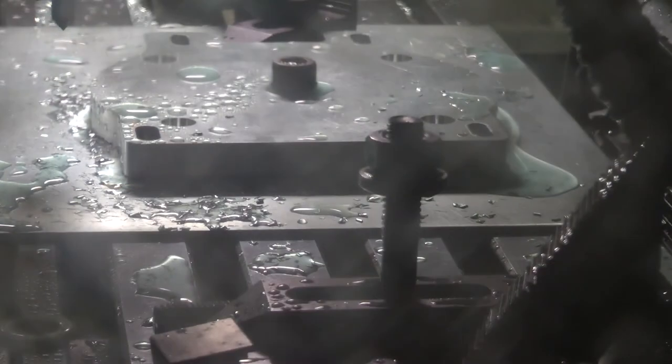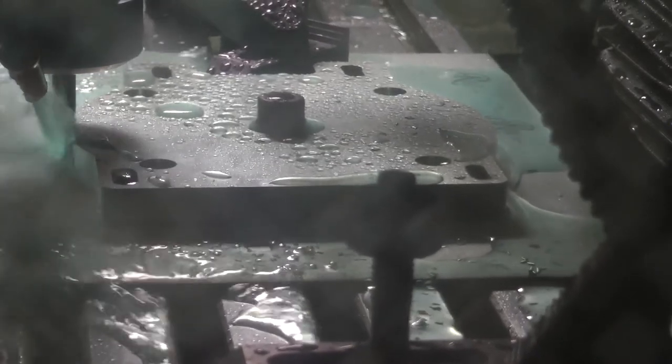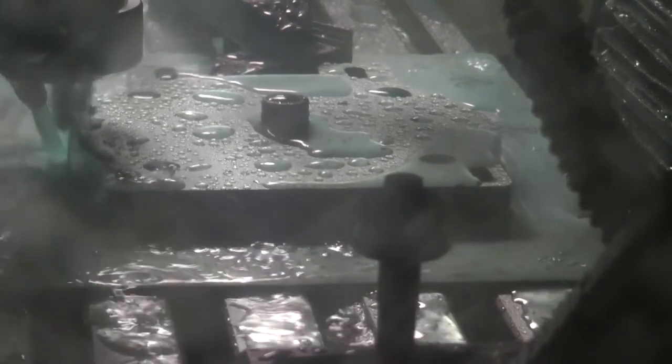This is a bit of an interesting cut. I wanted to put some sort of large 45 degree chamfers on the outside here, chamfers that were wider than the actual chamfer mill. So I ended up kind of stepping the cut in the CAM program. I used RhinoCam 2.0 and that worked very well. In fact, I think you may be able to do a very large chamfer by using this method. All I'm doing is stepping the 45 degree chamfer mill up and over on each successive cut, so it's sort of just following its own 45 degree contour.